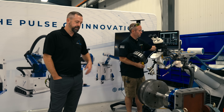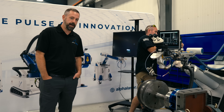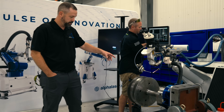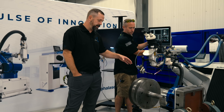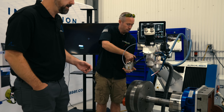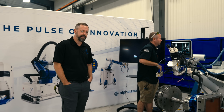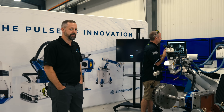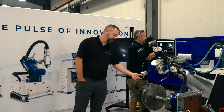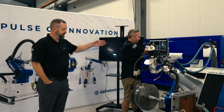The ALDV is a new style we got a couple of years back and all of our customers really enjoy it. It also has a handheld option where you can use the wire feeder by hand versus on the machine. This is a really flexible wire feeder unit — you can lock this arm into any position, achieving any angle you want to feed wire. It's great for OD shaft repair, anything outside diameter. You also have the ability to do inside diameter welding, limited only by how deep you can fit the wire feeder inside the internal diameter. Alex is putting on our spool of wire here.